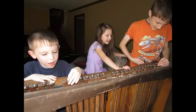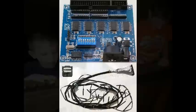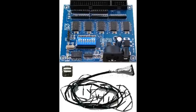The pedal board had some hardware on the ends of the pedals, and I removed part of the hardware, leaving the metal brackets in place. The usual way to convert a pedal board to use with a computer is to buy a set of reed switches and wire them up to a MIDI encoder. I bought a pre-wired set of reed switches and a MIDI encoder board from a company in Bulgaria that sells kits for this purpose. The switches came with magnets which I glued to the ends of the pedals.